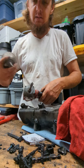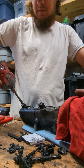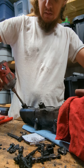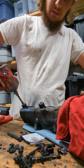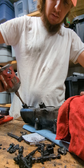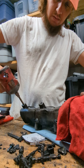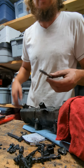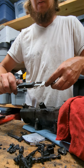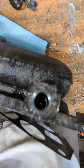Hopefully you can see that — a little bit of oil in here and I'm just using an impact. You want to go a little bit then bring it out because it can't do it all at once. I use it down to the base of the tap, kind of right here where it starts. It's got about an inch of useful threads; the rest are tapered because that's just how these taps work.